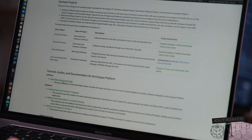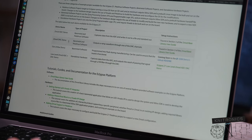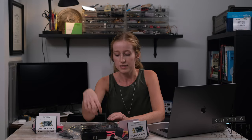The first thing I come across is we've got some example projects specifically — a Zmod ADC demo and a Zmod DAC demo — with both bare metal and PetaLinux examples. It looks like the out-of-the-box demo is actually already programmed onto the flash. They do it during manufacturing just to make sure that the board is functional out of the box. This is fairly typical for a lot of boards — they'll have a demo or a very simple hello world type image already programmed into the flash, so you can just plug in the power and plug in your USB serial port and actually see some output immediately.